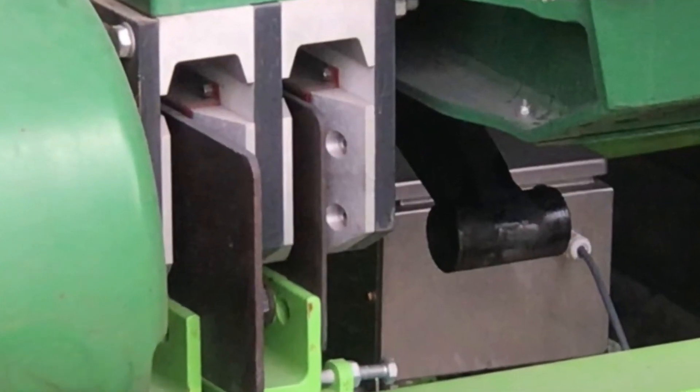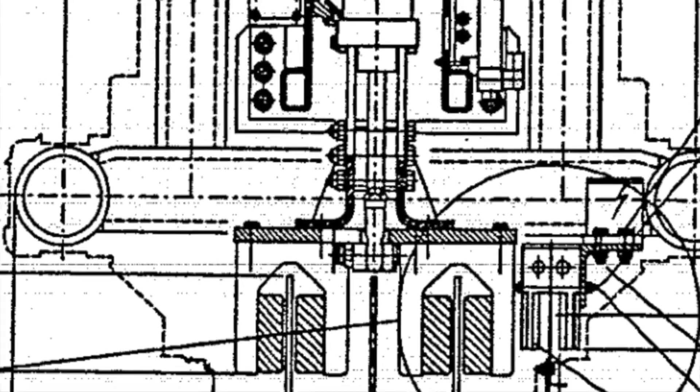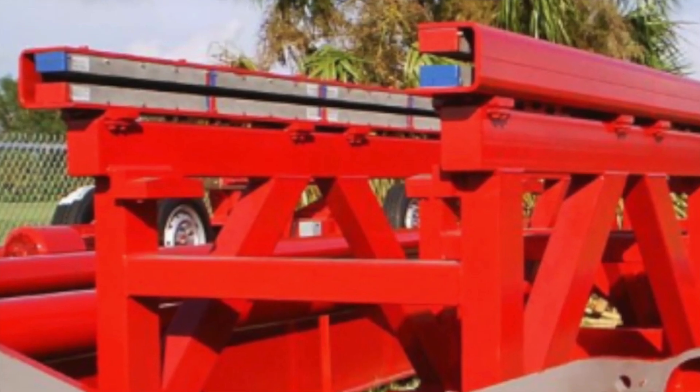The next thing is why magnetic brakes are used. I mentioned there's relatively no maintenance to them, and there isn't. The nice part is that whatever brake is in the applied position — whether fins up, shoes down, or whatever it might be — that can be done with springs. So in the event of a power failure, air loss, or system loss, those brakes will come up or lower down, whatever they need to do to slow down and stop the train. That is one of the fail-safes built into the ride.